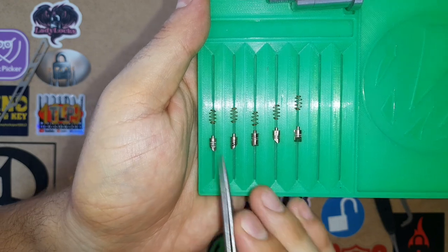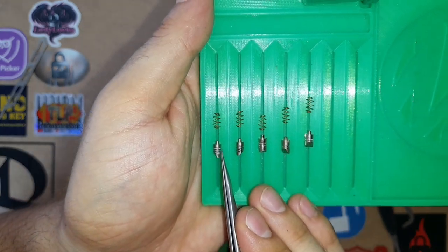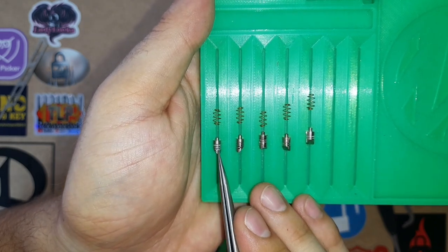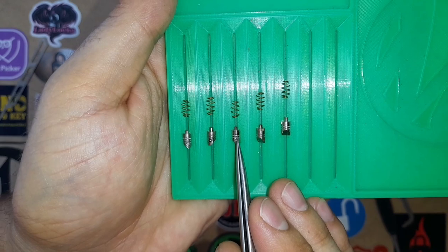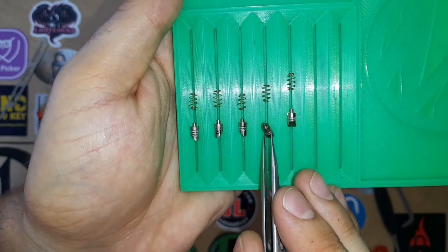As you can see, these two are high lifts, and you need to go through one, two serrations, and on the third serration, there is the true gate. These ones are lower lifts. This one you have to go only through one serration, as you can see.